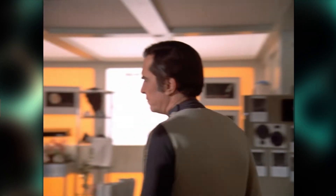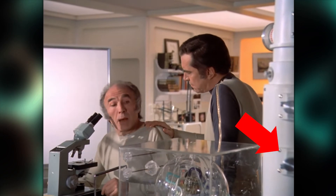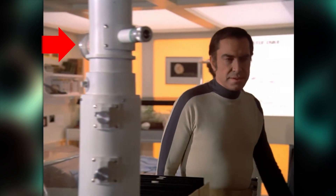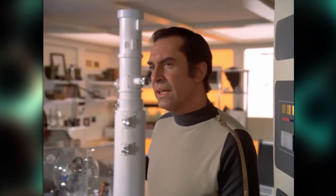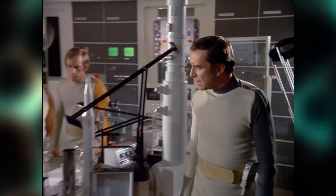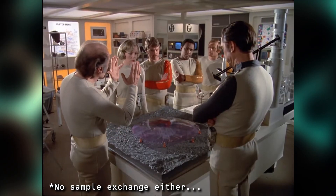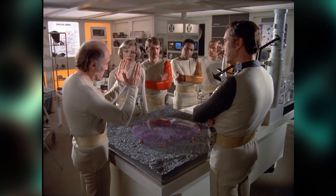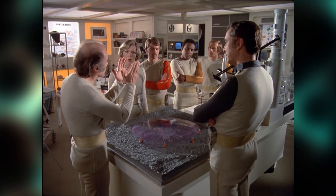So first off, we do have a thing here that looks like a TEM column. It's got some knobs for the apertures and something that looks like a flange for the vacuum system kind of in the back. I thought at first this might be a real column being used for set dressing, until I saw it sitting right on the very edge of this table. This immediately told me it's a mockup — first because there is no fish bowl at the bottom of the column, but also a real TEM column weighs hundreds of pounds and no sane person would set it so precariously on the edge of a table like that.